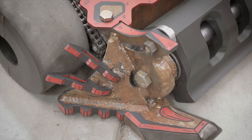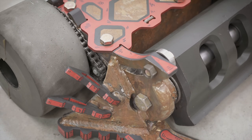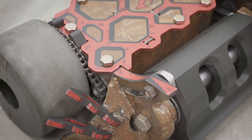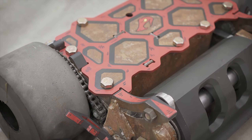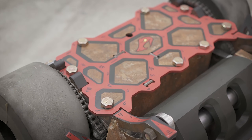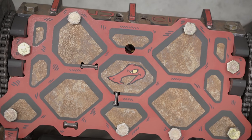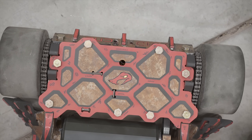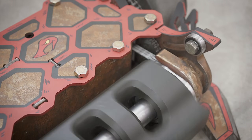We can't talk about this new version of Copperhead without talking about the new aesthetics. With everything going on in 2020, we thought it'd be kind of nice to go with a post-apocalyptic feel, so we stripped the old frame down completely — sandblasted all the old paint off, then used a salt and vinegar solution to etch the metal, and then a hydrogen peroxide solution to do all the rusting. This is all controlled rusting on here, and then all the paint details were added by my wife. She hand painted everything, and we really like that almost comic book or cartoon feel to it.